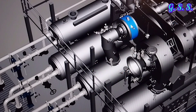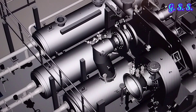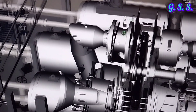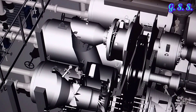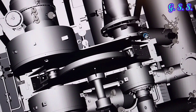This is the third stage casing, and if I remove the casing, you can see the third stage impeller. In the third stage, air is compressed from 5 bar pressure to about 8 bar pressure. After third stage compression, hot air goes to the third stage aftercooler. This is the third stage outlet to the third stage aftercooler inlet.